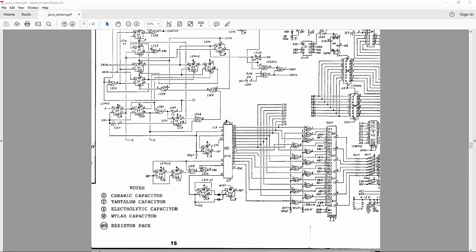But it ends up that when poking around, I found that sometimes the signal will come back, and tracing back, ultimately I got back to a custom chip, an EF13, 082, and the sync signal was pin 17 there. And I noticed if I moved things around, it would come back. And ultimately, I replaced the socket, and then everything was good again, which was weird because the socket actually looked really good. It looked tight and clean, but replacing the socket, boom, everything worked great again.